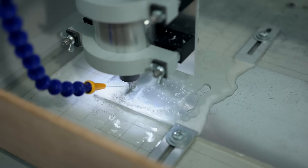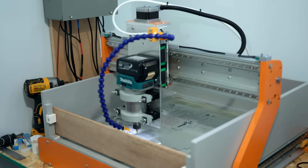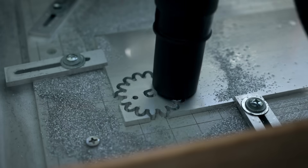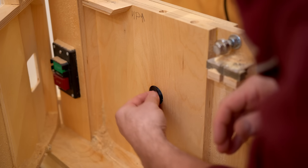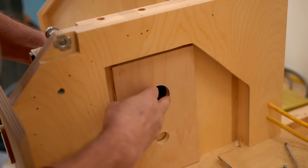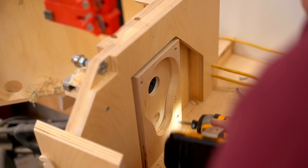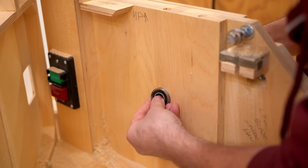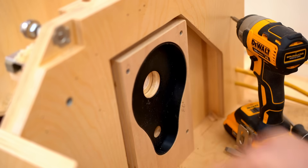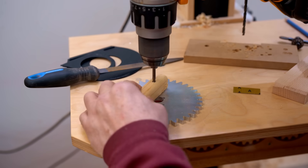Then it's back down to the metal cutting CNC where I'm cutting out the small gear. Another 3D printed part helps get everything lined up precisely. These are the two plywood parts that I cut on the big CNC. I can get the bearing put in and put the liner — once again another 3D printed part — in the opening on the other side, then slide in the lower wheel. Of course these gears need grease, and that's the reason for that black liner — to keep the grease in there instead of soaking into the plywood.